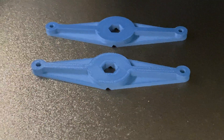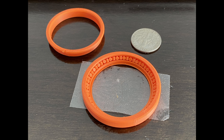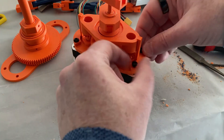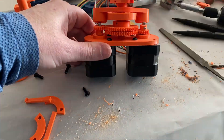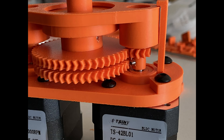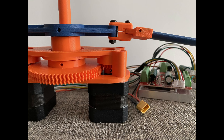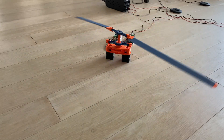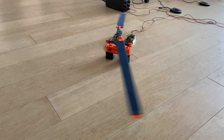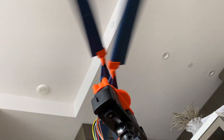So I designed a new hub with more rigidity. This time I made hex socket shapes for the shafts, gears, and hubs. This way things can be assembled more easily and with more consistent torque transfer — set screws love to slip under load. I fixed the issue with the blade clamps and now the blades spin freely from each other without drooping. However, the whole thing needs a more rigid mount; the camera mounts I have are just not designed for the size needed to hold everything together for the spin test.